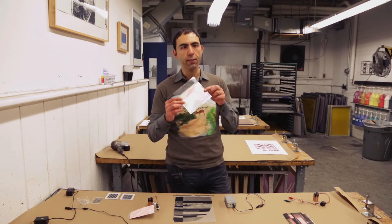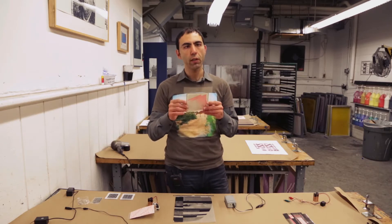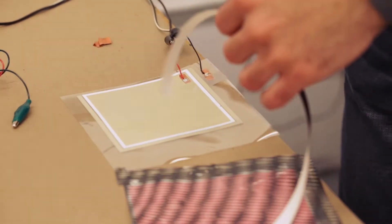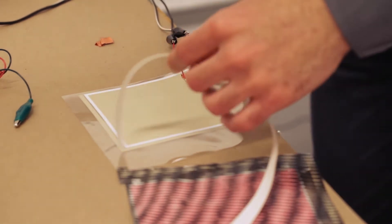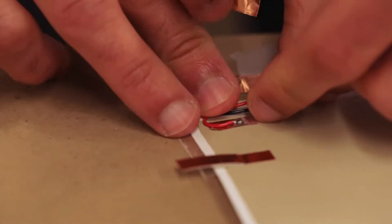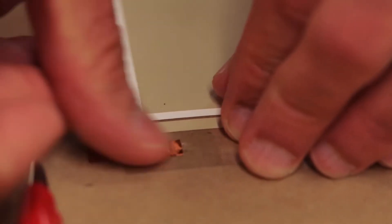This film is coated with an invisible tiny substrate that makes it conductive, and we print phosphor onto this layer. Then we insulate the phosphor with a dielectric layer and then put another layer of silver on it, so that the phosphor gets sandwiched between two different conductive layers. When we apply AC on it, it will start emitting light.